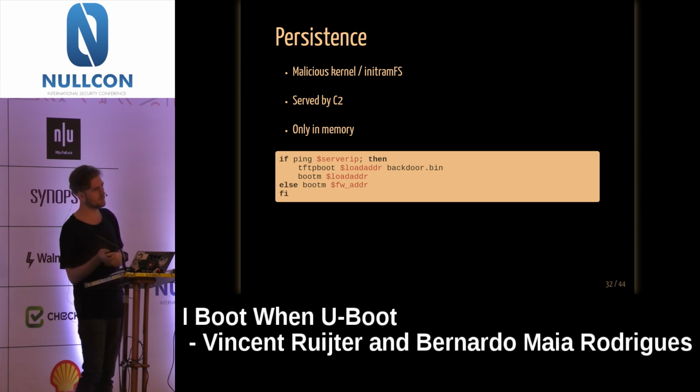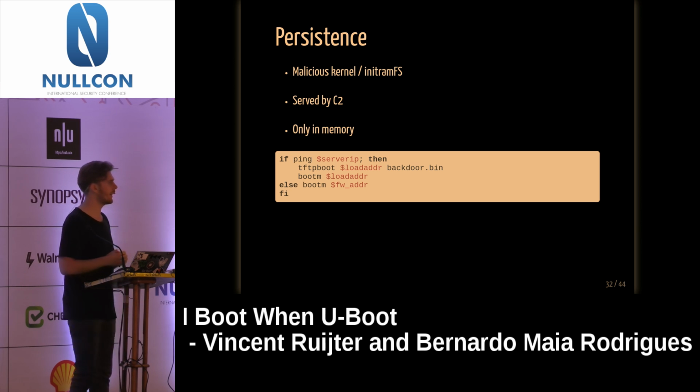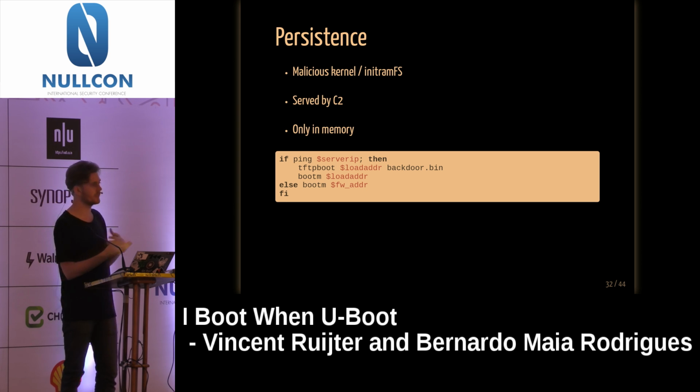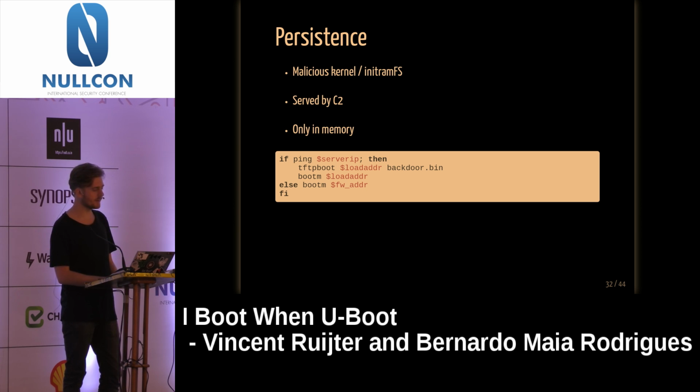We just load a custom kernel, and then we mount the actual partition from the device, and we just kick off the init there, and it will just be like a normal device, but it has our malicious kernel. So it does everything that the device used to do, but we own the kernel, and we can put any file in there, and it's pretty bad.